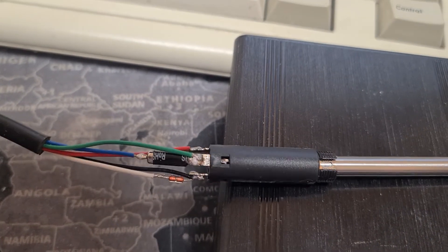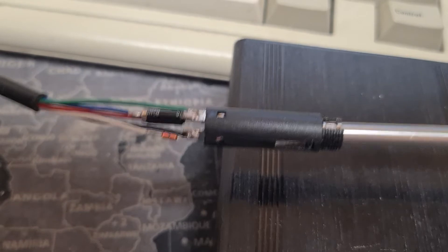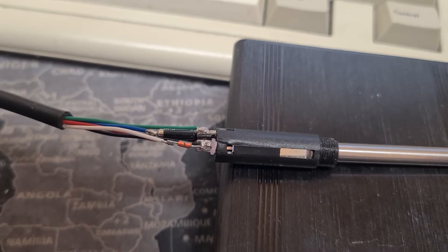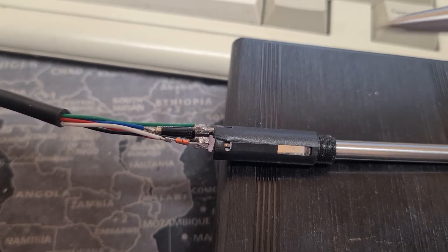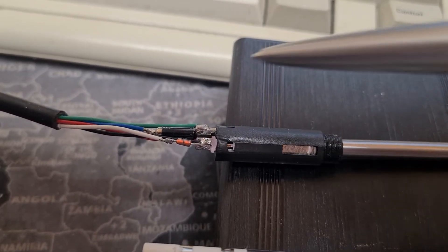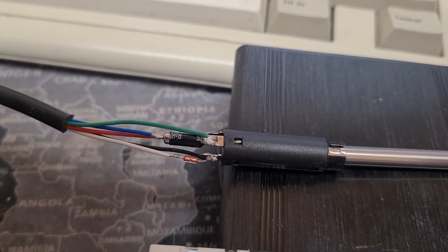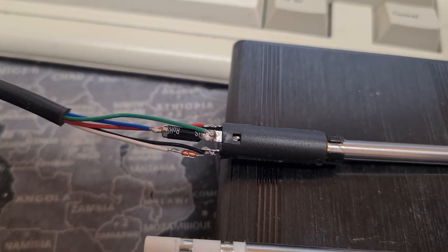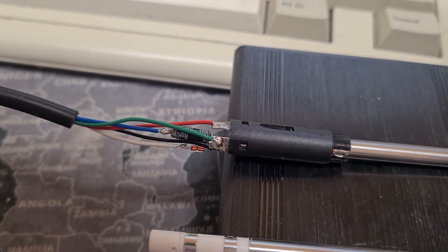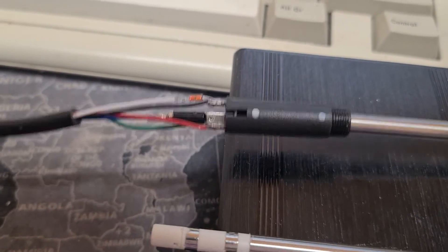There's also inside this Ross-stickered little tube — you can hear the ball vibrating — it's a shake-to-wake sensor, like a ball bearing in a tube. As it moves around it sends pulses down this blue wire. The sleeve is earthed and that's the green connection here, and this blue one is the shake-to-wake pin. The black cable is the heater current negative, and also the white wire from that is the cold junction sensor. Then the red one on its own is the positive supply — it's 24-volt DC. That's roughly how that works.